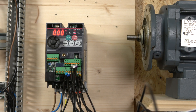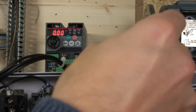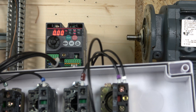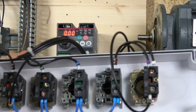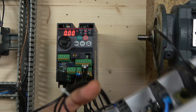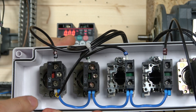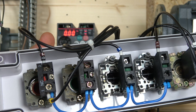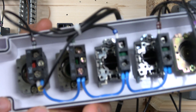The E-stop has S1 and SD coming to one end, and after the E-stop the cable goes back to S1 — so once the E-stop is clicked, the drive goes into error and you must reset it manually. We have a three-wire system where the stop button has the PC cable coming in, going through the stop button, and then one cable goes back to the drive joining STR. Under normal conditions STR runs the motor in reverse, but we've reprogrammed it — check the last video for how — to act as our stop signal, freeing up RL for what I'm about to demonstrate.